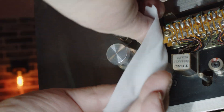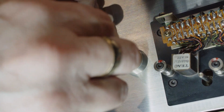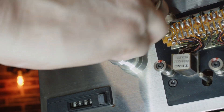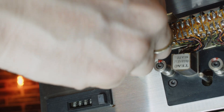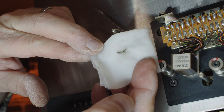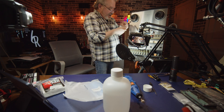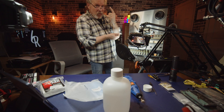Using a deck like this to transfer eight-track masters — I get it. But what it's going to do to the deck itself, just contaminating it — you've got to go through a total cleaning before you do another person's tape. I mean, it's going to get ugly. Those tapes, they want to preserve them, I get it, but you do the work for somebody, you do the ingest. When you bill them, you better factor in what it's going to take to clean that deck after one pass.